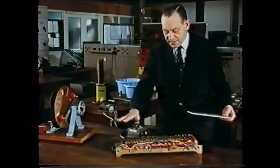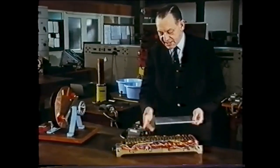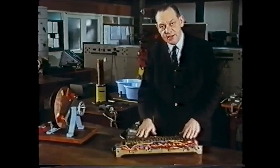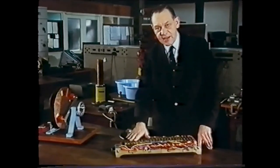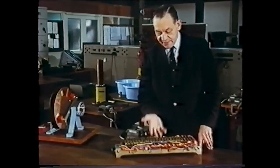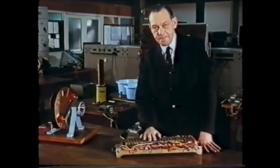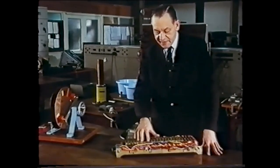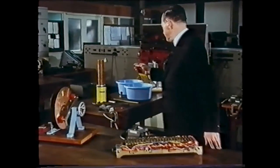This is the force we designed it to have. The lifting force is something, in this case, we really didn't bargain for. Now, this is the linear induction motor. In many ways, it is easier to explain how the forces horizontally arise than is the case with the vertical forces or with the forces we saw supporting the sphere. But simpler still is a demonstration of induction using a single coil and a single ring, like this.